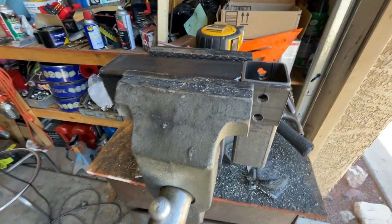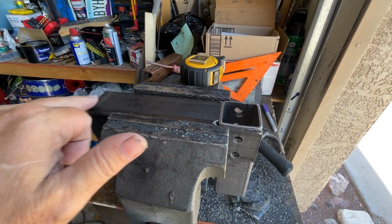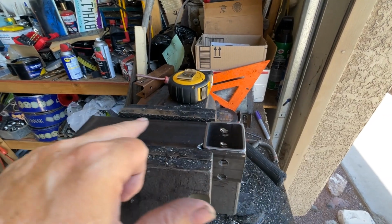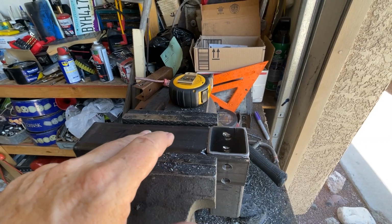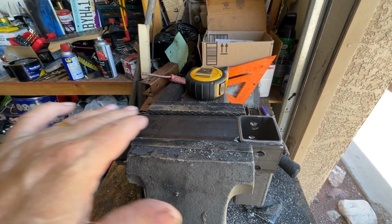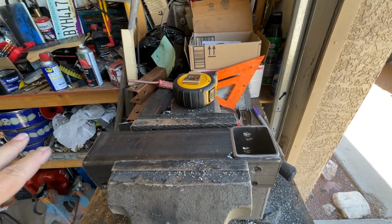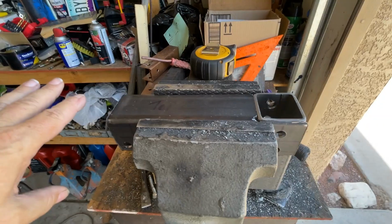All right, guys, so let's see if we can give you a little update here. Basically, this is your horn. This is 8 inches long. This is going to give you about 6 inches to mount a winch on your bumper. So if you have a larger winch that you're going to try to put on, and you need more space, then you need to make this horn extension longer, another 2 inches maybe. This is 8 inches right here. Make it 10 inches, and that would give you an 8-inch platform to mount to, and you could pretty much get a big winch on that.